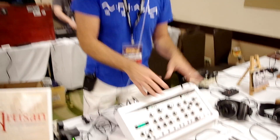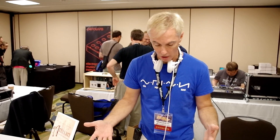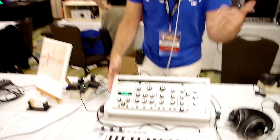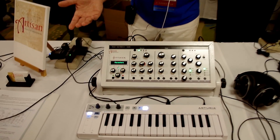It is an analog front-end sound source, so you've got analog oscillators, dual four-pole cascade filter, and VCA — and then digital control over that, so you've got patch storage as well. It records all of your knobs up front. You have four envelope generators with delay and hold, and four LFOs that have rate modulation, and you can do MIDI clock sync as well.